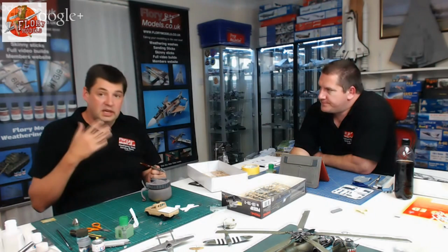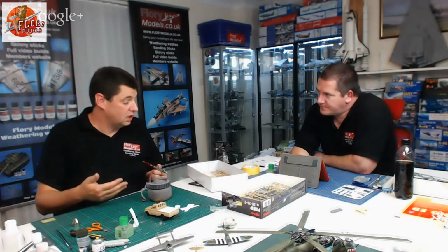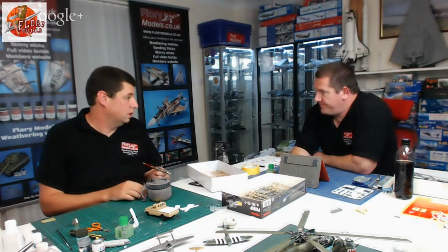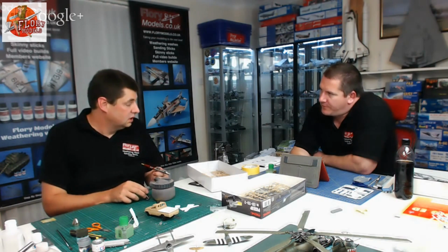It's easier to work with as well, because if you've got speckling, up your air pressure. If you've got spidering, lower your air pressure. That's all you have to worry about. Don't worry about the variables of thinning, because trust me, you will be chasing a unicorn. I suppose it doesn't really exist. Comfortable for you and what you're used to.